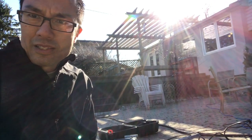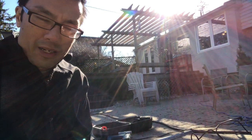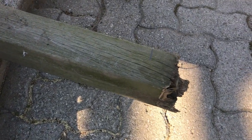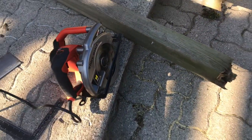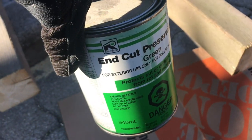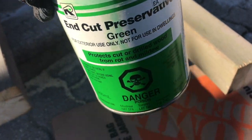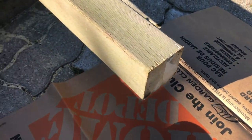I'll show you the can — it's this green stuff that just goes on top of the wood, seals it, keeps it nice and dry so it doesn't get rotten. I measured down to about six feet, which gives me enough to cut off the rotten end pieces. Then I use this can of end-cut preservative — I had this on hand — and it helps protect the pieces exposed to water from rotting.